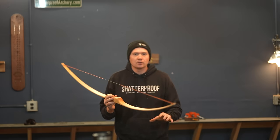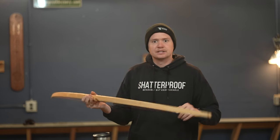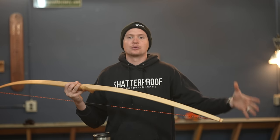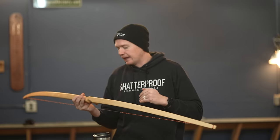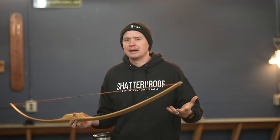I would be careful to not go over a 30-pound bow. Because we have no backing, there is no growth ring chased. We're keeping this build simple, remember? But the downside to that is that you can't make a super heavy poundage bow this way.